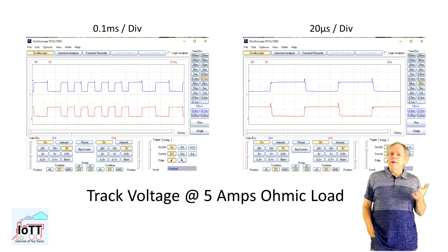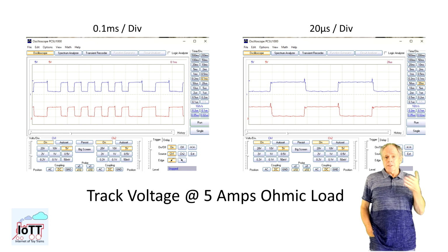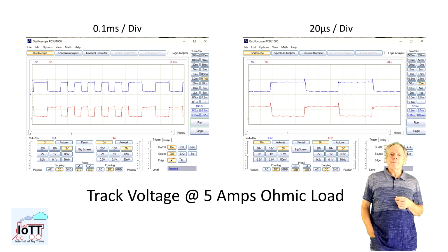When loaded with 5 amps, the signal still looks good and symmetrical. The voltage is lower because it is reduced by the power supply to limit the current to 5 amps. Also, the short spike at the end of the DCC half bit is due to the voltage regulation of the power supply. It just shoots up a little in the moment the current is shutting down. So that is pretty good. It looks like the IBT-2 makes for a cheap, powerful and high quality output booster.